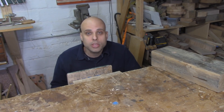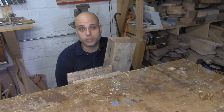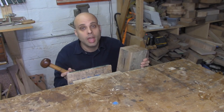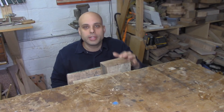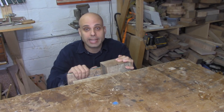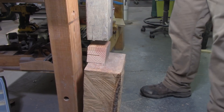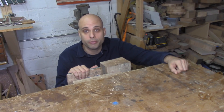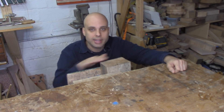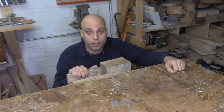The last thing you need is a striking surface. I own a good anvil, but it's outside and covered in snow — and maybe you don't own an anvil at all. That's fine; you don't need one to practice. What you just need is a decent piece of hardwood. This is just a piece of scrap oak that I got off the side of the road. I'm going to put it in my vise at roughly the same height my anvil would be, and slide a couple of scrap blocks underneath so the vise isn't taking the full force of the hammer blows. If you don't have a big hardwood post, you could even use a construction-grade 4x4. You'll mash up the top pretty quickly, but take a slice off and keep working. By the time you reduce the entire thing to wood chips, you will have taught yourself a lot about hammer control and moving stock around.